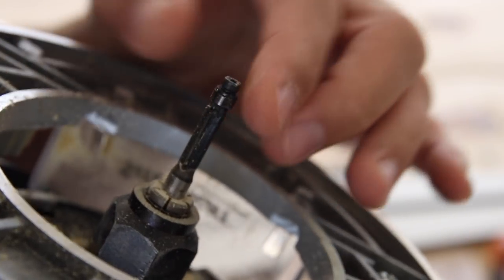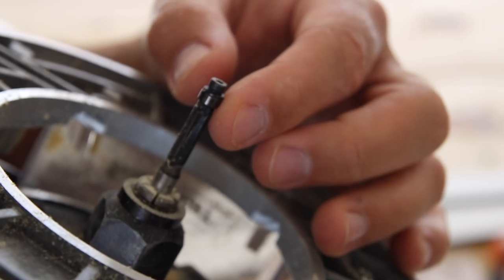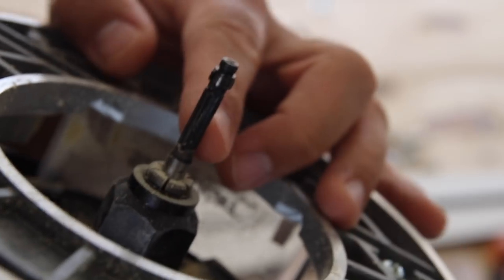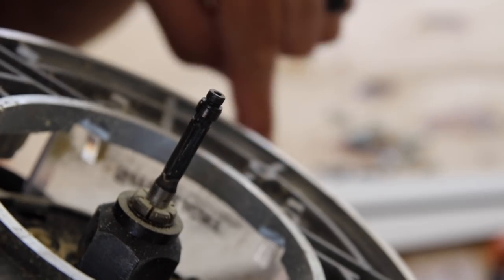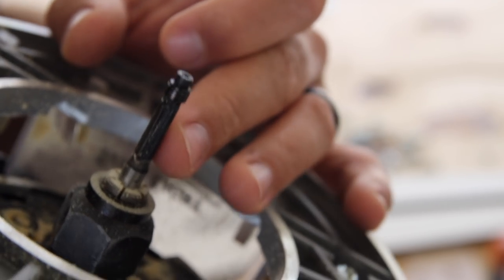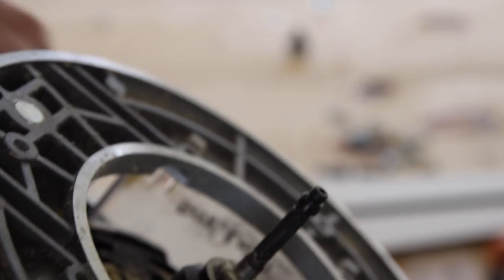Now, when I got done, because my router bit was not long enough, I had to finish it off with this. After I cut it out with a jigsaw, I went back with this bearing, the guide on this router bit followed what I cut with the other bit, and then the part of the router bit there that's below that bearing cut the remainder of what I couldn't reach. So in my case, I had to use both of these bits, but in your case, if you have a longer router bit for the initial cut, you won't need this.